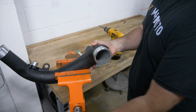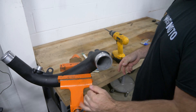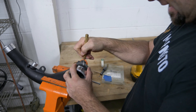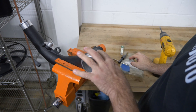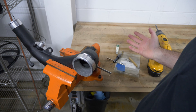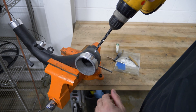I'm just going to put it in a clamp, vise it, make sure it's sturdy. You want to center punch exactly where you want your drill and tap to go — so this will be my spot. That provides a nice center point for the drill not to walk around. We're doing a standard 1/8-inch NPT, which is pretty much the most common fitting in the industry for drilling and tapping.